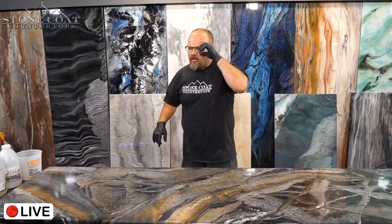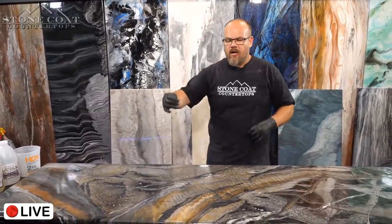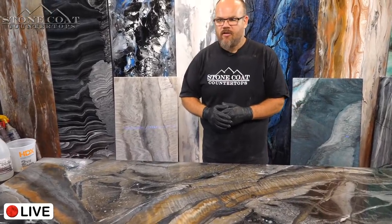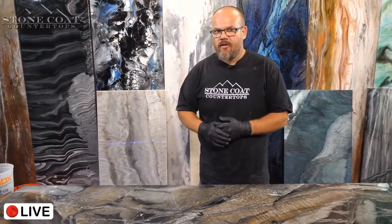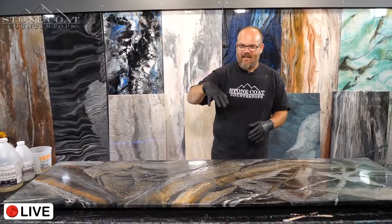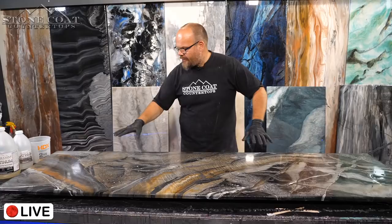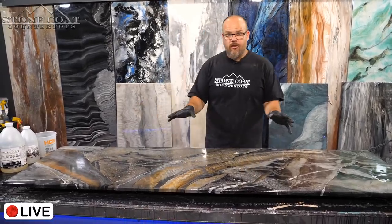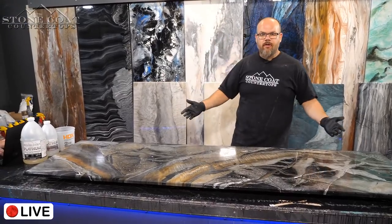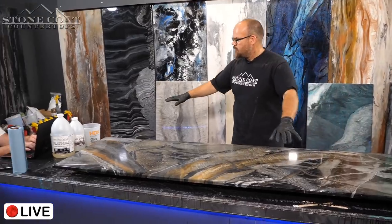If I want to make a rainforest green granite or something like that, it requires some late techniques. It requires some things that aren't kind of standard in working with coatings. So we push the limits knowing that we have that insurance policy of a clear coat, and that's what this video is about. One of our biggest questions from a newbie is, hey, I got a divot. How do I fix it? Well, you do a clear coat and you don't worry about it in the color coat. Right, Mitch? Correct. Cool.